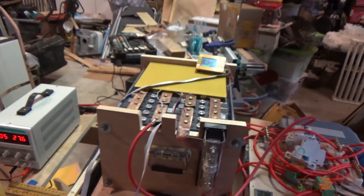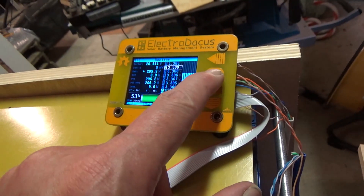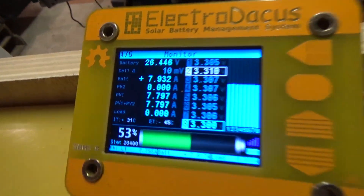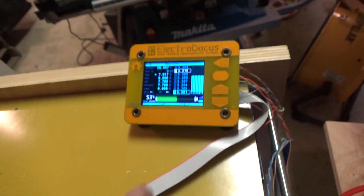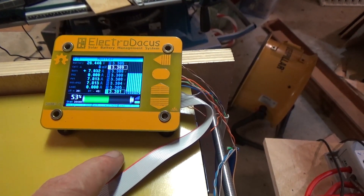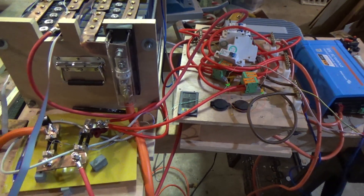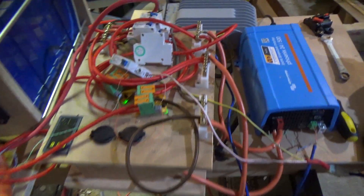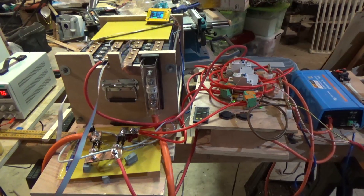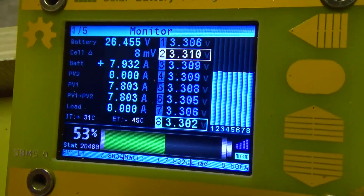The proof of the pudding isn't in charging, it's in discharging. That's not going to happen until we hit 100%. We're sitting on 53%, 200 watts, that is just under eight amps. Because I've disconnected this, it started at half, so I don't really know how much capacity I'm at, but I'm guessing it's going to take all night. My charging circuit really does look like I drew it. I'm going to let this charge — that's going to take probably all night, maybe all day. Still under 10 millivolts. Loving what I've done there.